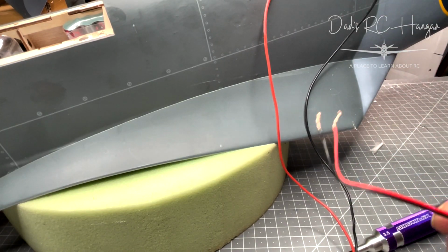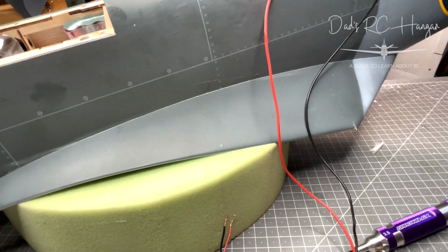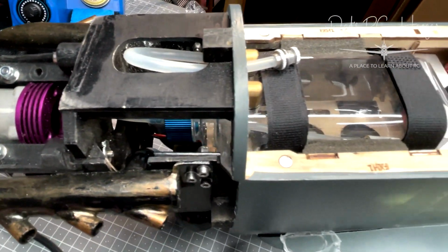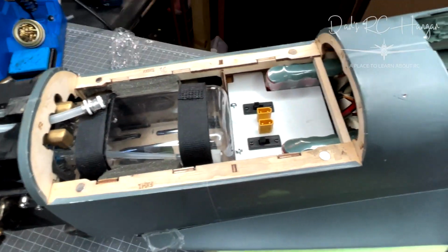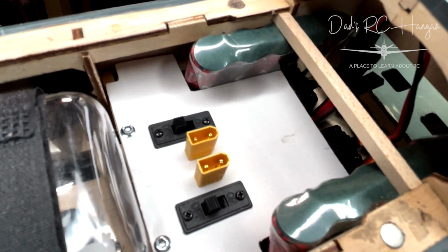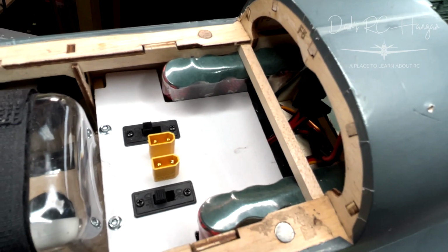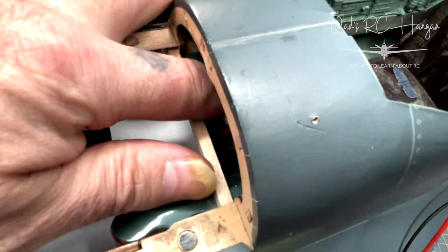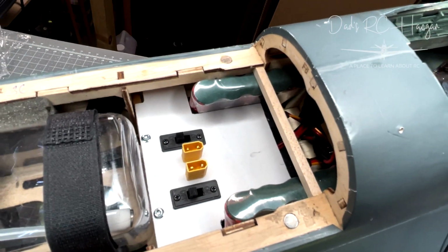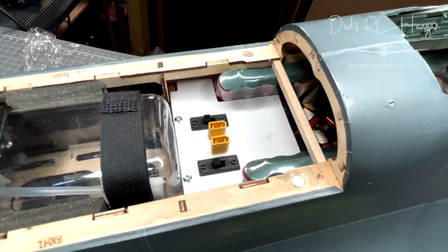And as I say, we've got the LED that's run on that side, and the switch I've got to figure out what that is. But there you go, it's all looking really sexy. But as you can see, all these sorts of jobs take time, and I don't video them all. There's the little battery cells, on, off. They're not connected at the moment. The other ends of the batteries, if you can just see back there, will connect to the batteries, and then you won't need to disconnect the batteries, because you just put the XT30s here and that will charge.